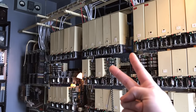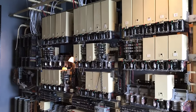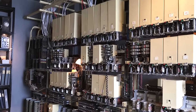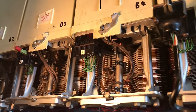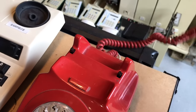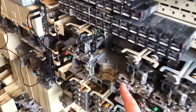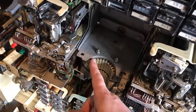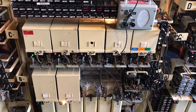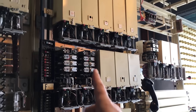You use the same pair of wires whether you are calling someone else or someone is calling you. The switching happens within these selector switches so that you can't have an outgoing and an incoming call at the same time — that's why you get that busy tone. So when I lift up this handset, there is a switch underneath it. That connects those two wires together and tells the exchange that someone's picked up their phone, and then it needs to find that phone. That's the job of these line finders here, and all of the phones are connected around this bank. Once one of these line finders has connected to your line, that pair of connections is then passed to one of the group selectors, and you can begin to dial and find the telephone that you want to call.